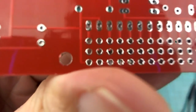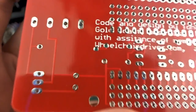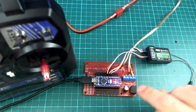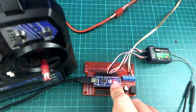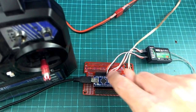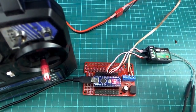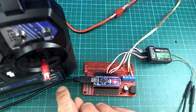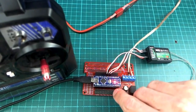I guess maybe the version of this design that Tony uploaded was a little bit out of date or something. When you're powering it through here — I'm powering it with 15 volts at the moment — the LED will come on but it's a little bit dim because the power is not coming directly to this VCC pin. It's going through the DG419 or the RS485 somehow to power the Arduino in a roundabout way and not getting full power in. Not a big deal — I can just put a little solder bridge across those two pins and everything should be fine. If I run it from USB from my computer it runs fine anyway, but when I put this on the wheelchair in the final version I'll need to bridge that gap.